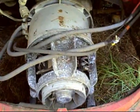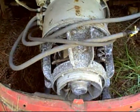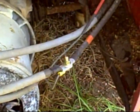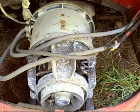Siemens 40 horsepower electric motor, separately excited — meaning basically you've got your big wires for the commutator and another set of small wires for the field circuit.